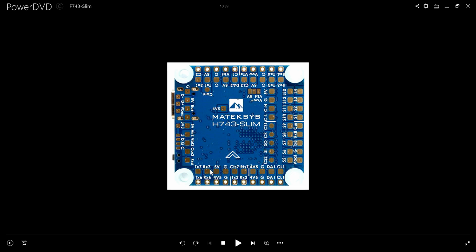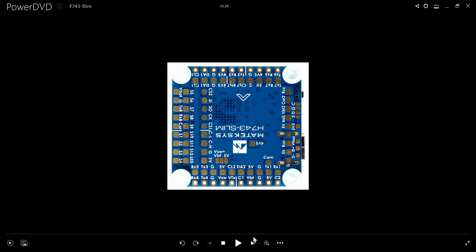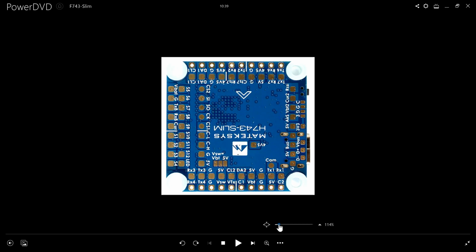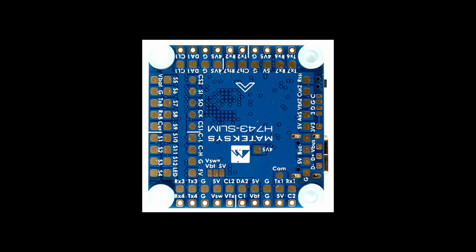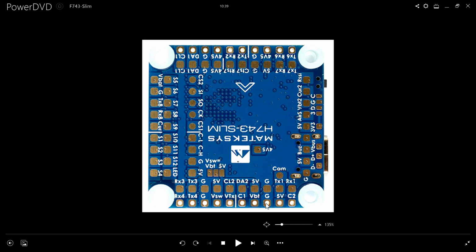And that will finish the back of the flight controller that I want to solder. So then I will go to the front. I'm going to turn this around a little bit just so we can see it better. And on the front, I'm going to hook the camera. Here's camera one video, camera one voltage and ground. And then I'm going to pick up smart. I'm going to pick up this UART TX1 and RX1 right here for the UART on that Josh Bardwell RunCam Phoenix 2. So I'll be using those five on the camera.